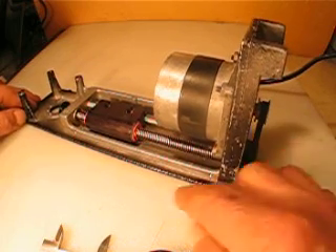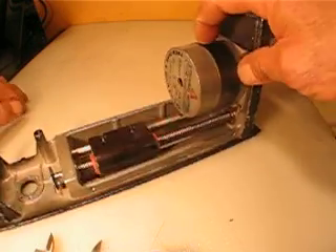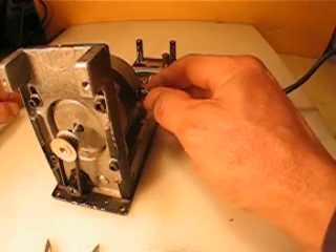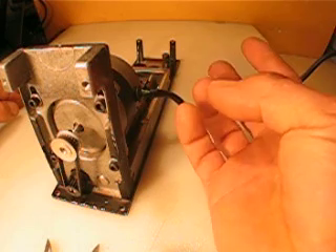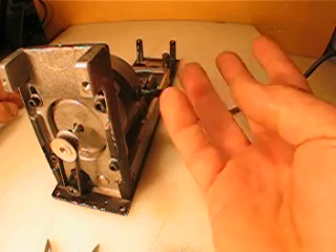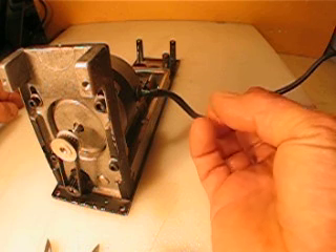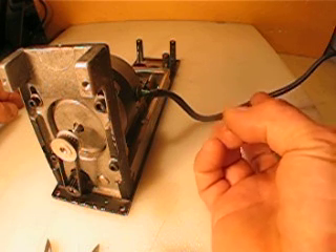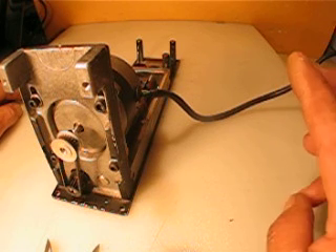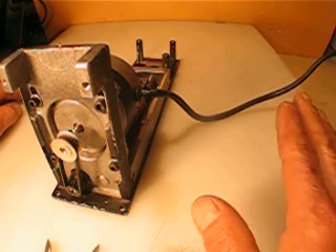I want to take some pictures with the measurements for you to check. The motor is NEMA 23 with six wires, very common — red and white-red, green and white-green. Each is one-phase and two-phase, and the center tap is white and black. If you have a driver that uses just A and B — A and A minus, B and B minus — you can leave the center taps alone.